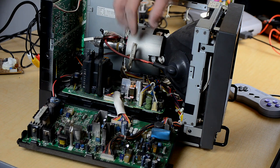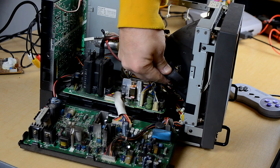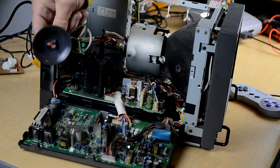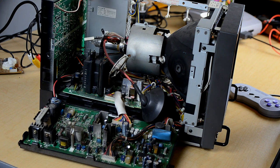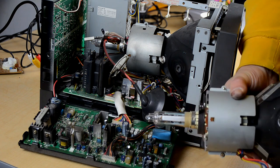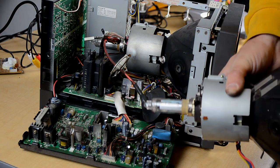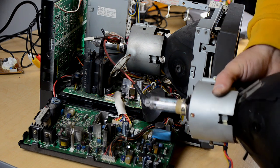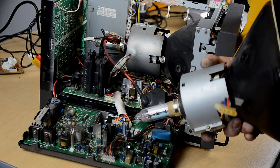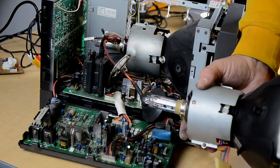I wanted to show you something — this one is not like the other H series where it has an anode cap that can just be popped off on its own. We can just change the tube and the yoke, and that can come from another monitor that's either the same, or you can cut the other assembly off from your spare monitor if you don't need it. This one also accepts the same tube from the 8020, which is a different older monitor but has the same ring anode and the same build out for the CRT, so it's a good substitute.